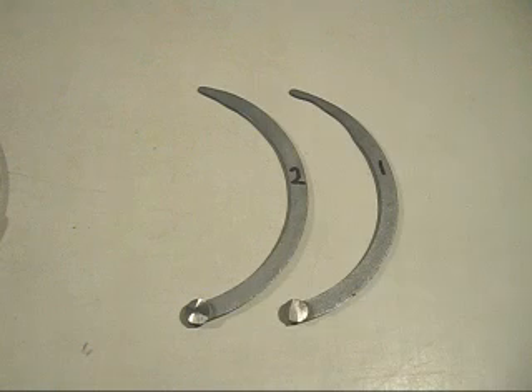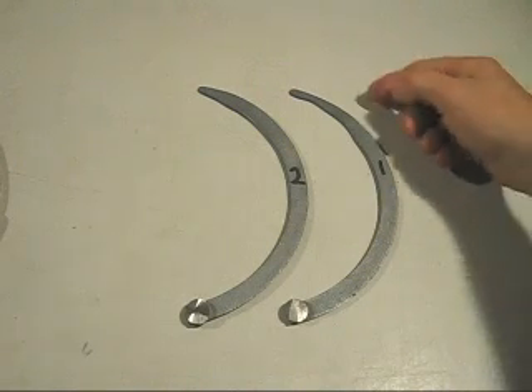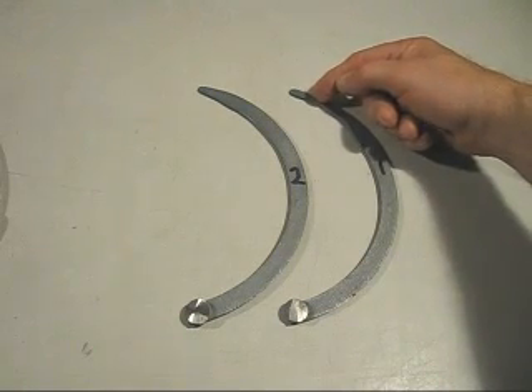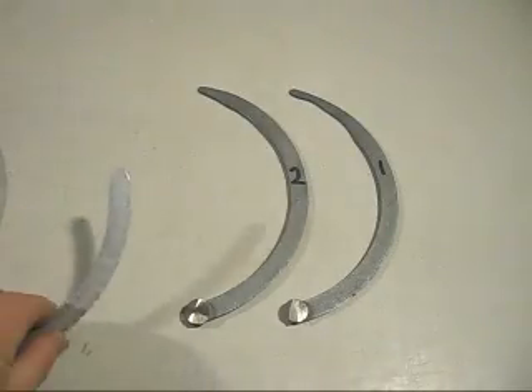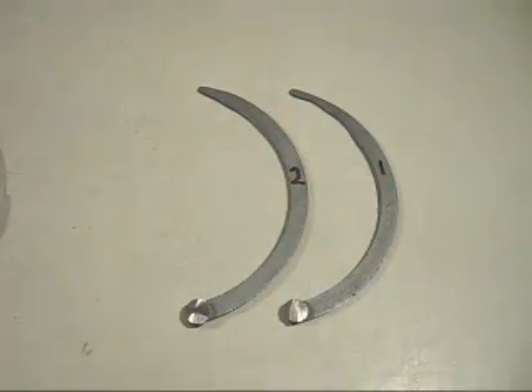The two moulds you saw me pour after the first one are my fluidity test. Nothing special here — they both showed roughly the same distance, but what is a little bit different is there's a bit of a taper between the ends, and with aluminium it's got a nice rounded edge. But I'll ask the question: does ferrosilicon have its limitations? Well I'm about to find out.